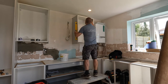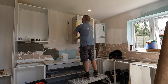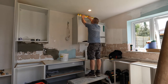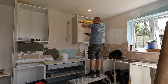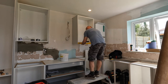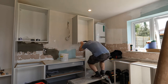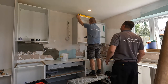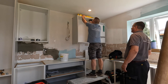You'll see me checking the level from one unit to the other to make sure they're all at the same level. Even where there's nothing in between to show a difference, you need to be dead on — using the level on top and on the side. The more plumb and level the units are, the less you'll struggle to adjust the doors and drawers. This will be a two-part video.